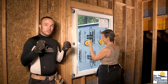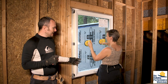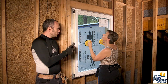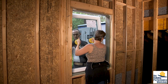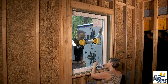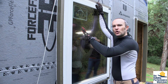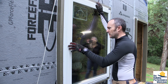Let's get started — suction cups on. You're going to need two of these because one hand and a hand under doesn't work that well. Having both hands outside of the frame is really good. First, you get it up in position by resting the outer edge on the windowsill, then lift it up, cant it, and bring it back so that the nail fin is up against the outside of the sheathing. Then level it, make sure the bottom is level and that the gap all the way around the window is the same. Attach it from outside — there's no need for shims because you're going from outside in, so we're not putting stress on the frame at all.